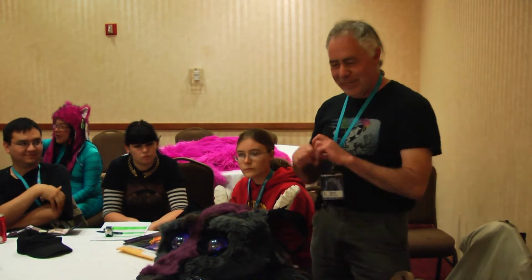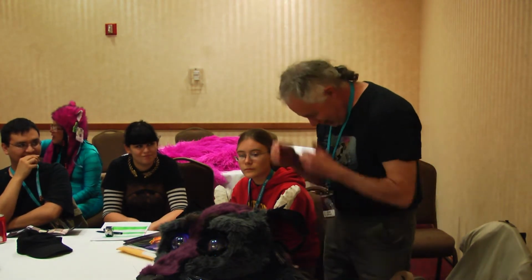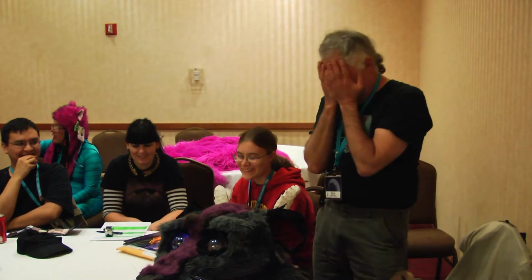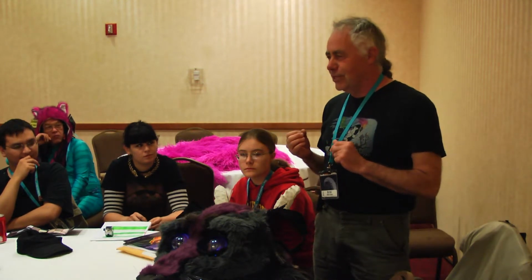First you get the fur all off, and I'm a hot melt glue gun guy. It takes a bit to get the fur off without doing a lot of damage. But once you get that apart and you get the servos in, don't glue anything down. That's my recommendation at the beginning.